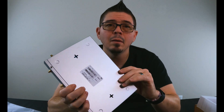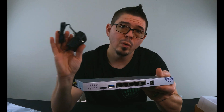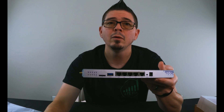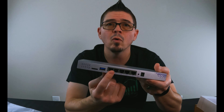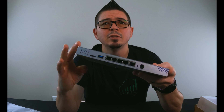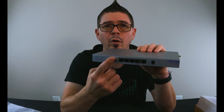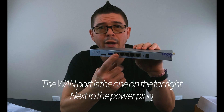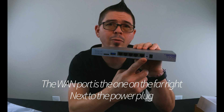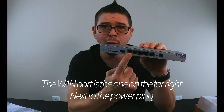The NEX-P1-GO router also features 48-volt DC POE capability, meaning you can power this router optionally without the power supply. You can power it via the WAN port for remote installations — installing outside, removing the router board from its case and putting it in an outdoor enclosure — powered with 48-volt DC POE right into the WAN port. It will not pass power through to the Ethernet ports; it takes power in only through the WAN port.